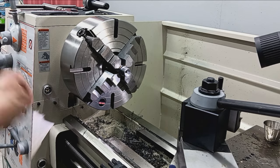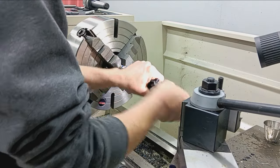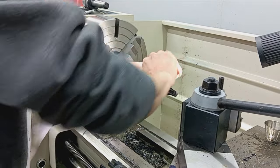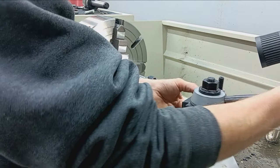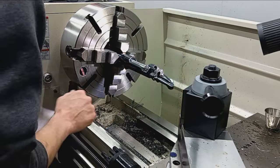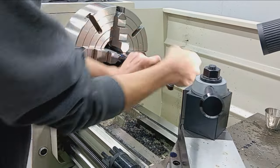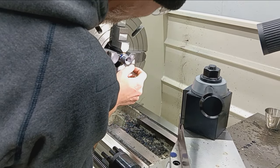All right, action, there it is. Face is clean. So that should allow the bolt to close. Closes, and there's some movement, just means it's got clearance. Cool, this barrel's ready for chambering. All right, excellent. No marks that it was hitting there, so we're good.